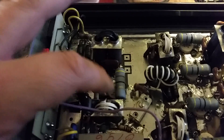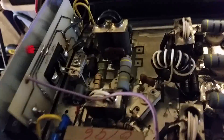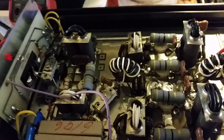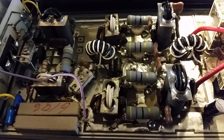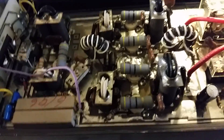These amps normally come with a smaller transistor like a 455 driver. We've done a little bit of work to it — it's pretty much like a 454 driving four 454s. Done a little bit of mods to get it to accept and handle that. We've thrown a 1000 and a 100 going to ground right here. I've added feedback circuits to the whole amp. Feedback circuits keep the amplifier from oscillating, keep it balanced — if anybody gets a little crazy with driving it, it helps.